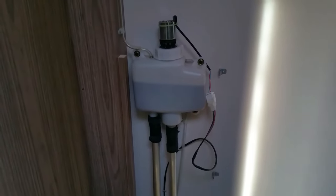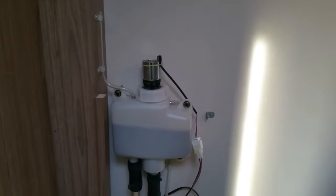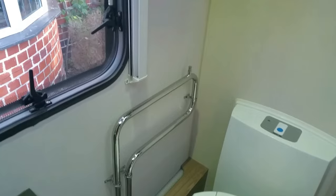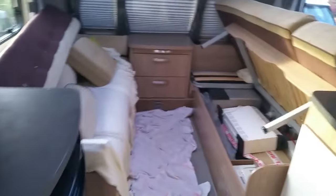The caravan heating has now been running for an hour or two after the fluid replacement and it's working perfectly — no leaks, no gurgling noises or anything like that. I vented the radiator again and the fluid was nice and clean, definitely the new chemical. Job done.